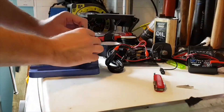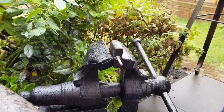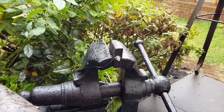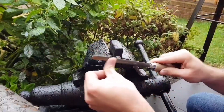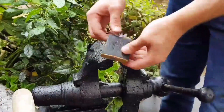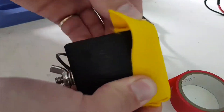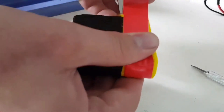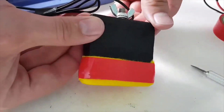The bolt was a little long, so I marked off where I needed to cut it, took it outside, popped it in the leg vice, and cut off the excess using the hacksaw. Once that was done, I tidied it up with a simple file to make sure there were no sharp or jagged edges and nothing the wing nut would catch on. Once trimmed back, the wing nut went straight back on — and there's your applicator. All we've got to do is pop a little bit of felt around the brass head end and secure it in place with some electrical tape. That is literally the last step — a completed applicator, ready to use.